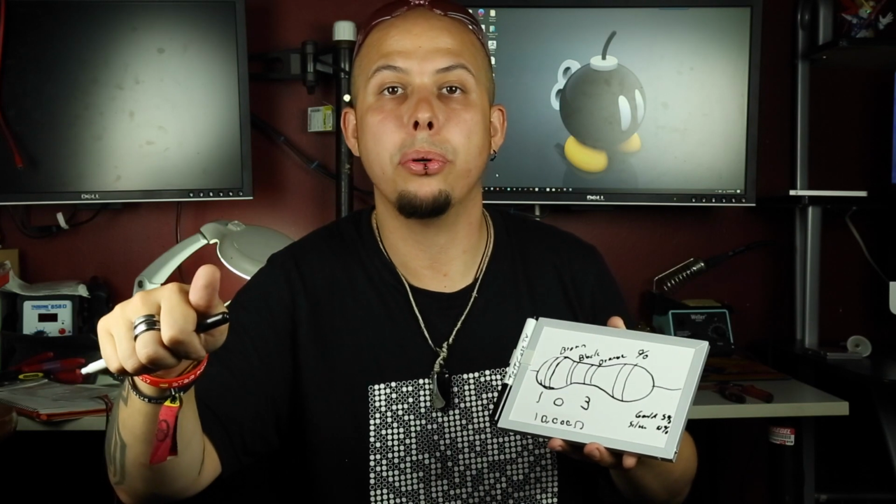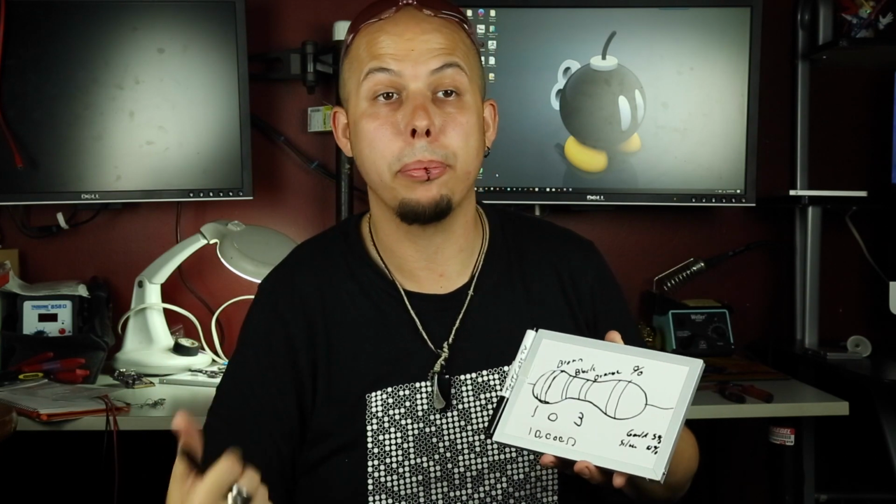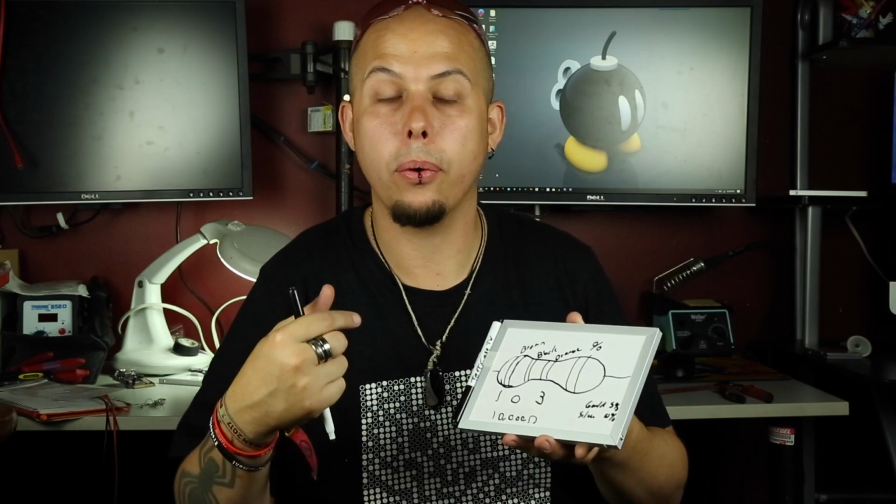So you'll attach this to your voltage source, and then on the other side of the button will be a ground. So when you hit it, then you have the allowance to pull that pin high or low depending on the state of that button. So a lot of controllers use that. If you open up an old Nintendo controller or SNES, it's the same thing. So it's not new magic science. This is bare bones basic, for one of the reasons you might use this.